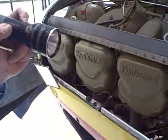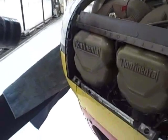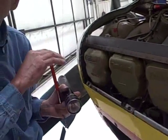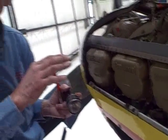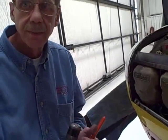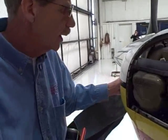Would you mind speaking about the number six cylinder vent tube, which I don't have — what is your feeling on those? Well, how's the cylinder temperature running right now? It's the warmest. We've seen where we put them in and drop it down a few degrees — it's about 20 to 30 degrees hotter than the rest for most operations for CHT. That would put it pretty much within a 10-degree window for all cylinders.